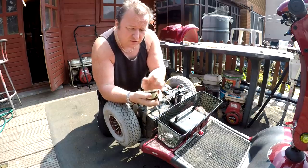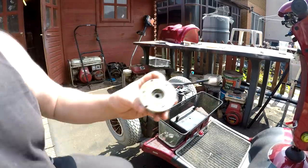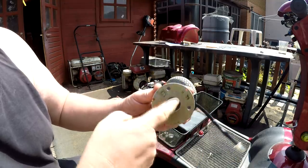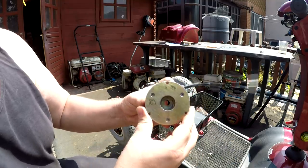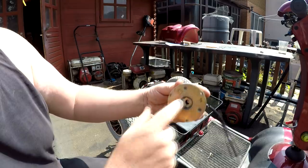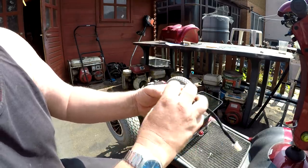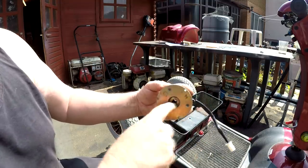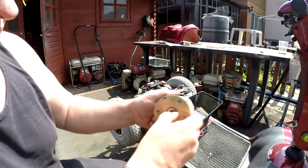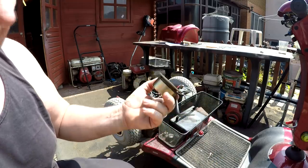That didn't really sound true to me, but the proof is in the pudding. When I apply 24 volts to this — this is the old one — this middle hexagon shape is a plate, call it a clutch plate. When this energizes it frees that off and allows the motor, which attaches to that hexagon, to free-wheel. When you take the 24 volts off, it de-energizes, brings that brake on, and you can't move that hexagon shape. That wasn't moving at all, even after I stripped it down and cleaned it. You're not supposed to lubricate these anyway.